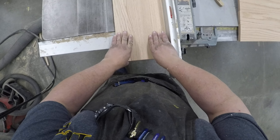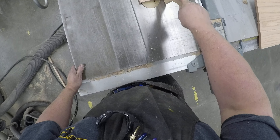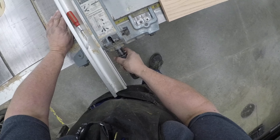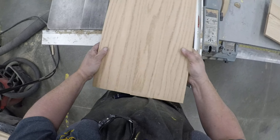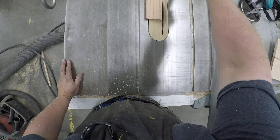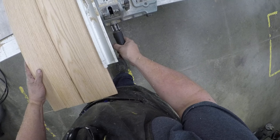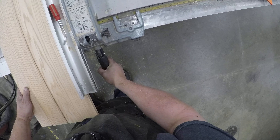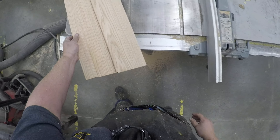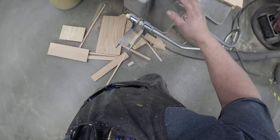I'm going to start with both hands behind the saw. I'm going to take my push stick and let that fall to the floor. My final width for my bottom is ten and a half, and the final width for my side panel is eleven. You can see that as I used the saw I did not have the guard in place — that was for demonstration purposes; normally the guard would be up in place.